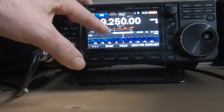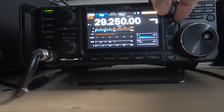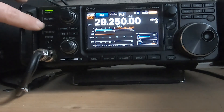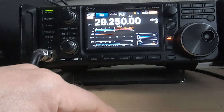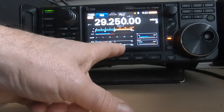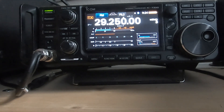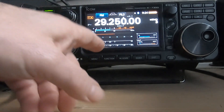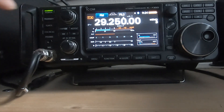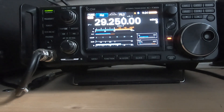Let's see how much actual power it's using. It'll help if you turn the power up to 100. SWR 1.5. It's a good 20 amps - we'll tune it in again. Now we can see 17 - flickering SWR, so it's kicking out good full power. But if we turn the tuner off - I can only key up for a very short time - you can see the SWR was way up and it's been restricted to 6 amps. The radio is doing that to protect itself. Tuner on - lovely. That's 100% power, and we can see the amperage there.